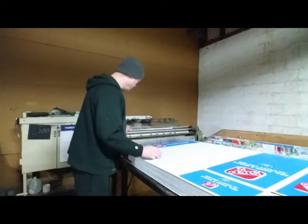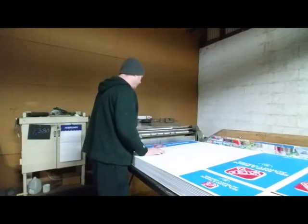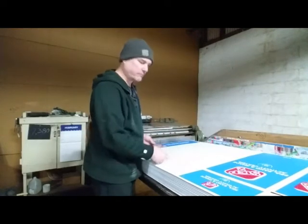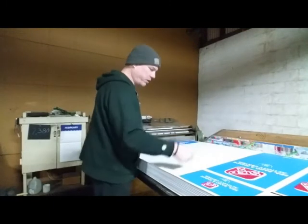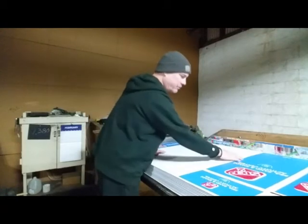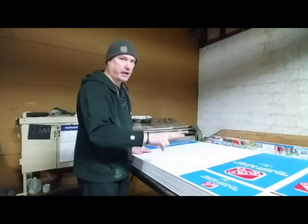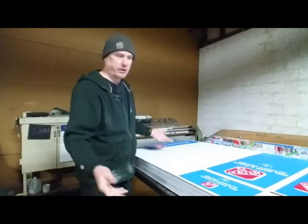Anyways, my finger's a little sticky. When you bring it through, you have to catch it and bring it through, and you want to put it right on the box. It's like a big piece of wallpaper. So if you don't get it where you want it, you have to pick it up and put it back down, pick it up and put it back down. But you have to be careful, because every time you do that, you'll get glue on the box, and sometimes it'll make that roller sticky, and you keep doing that, it'll peel the label off around that roller, then you got to go down there and take it off. It's a pain in the neck.